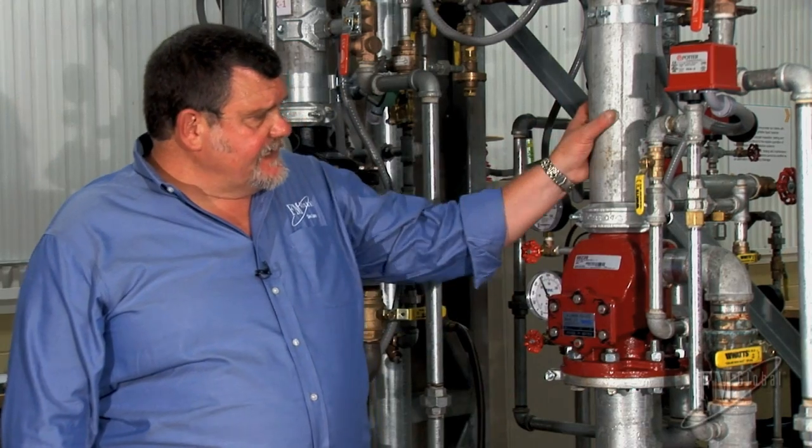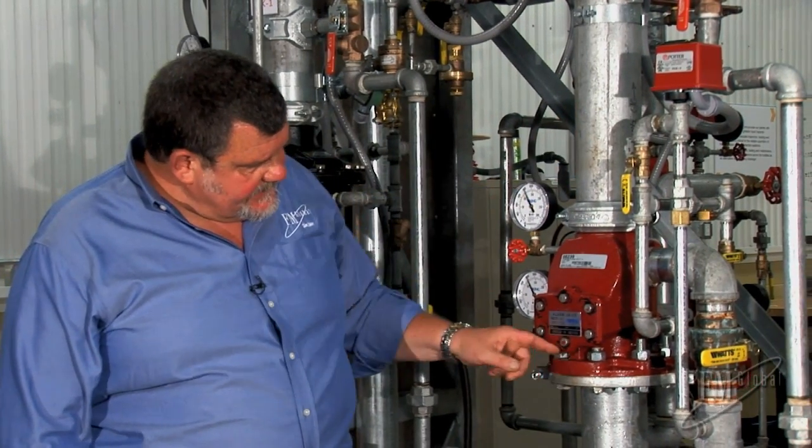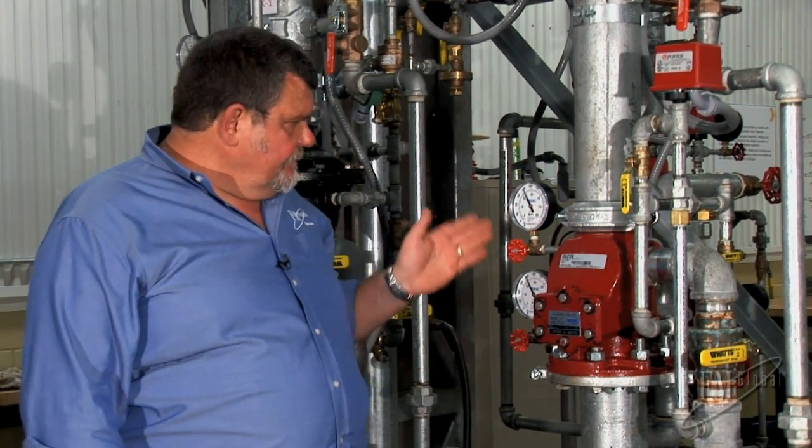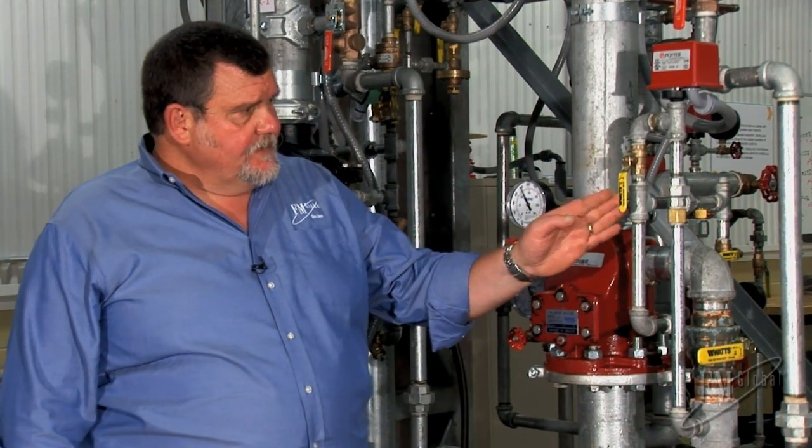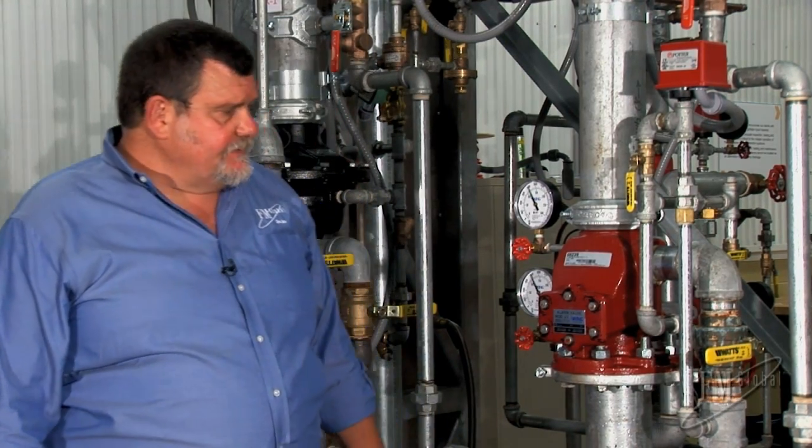All right, so now everything is back in service. No leaks on the alarm valve. Our water pressures on the gauges are back up. Our drain valve is completely closed. Our normal valve to the alarm line is open. And it's time to test it.